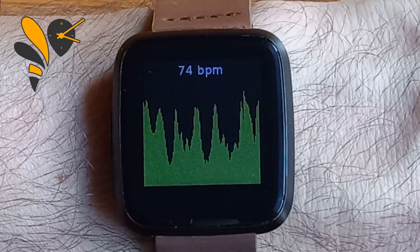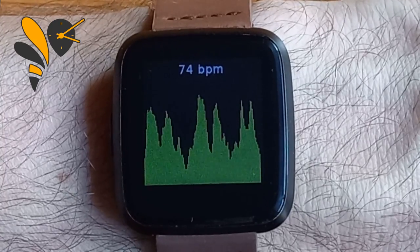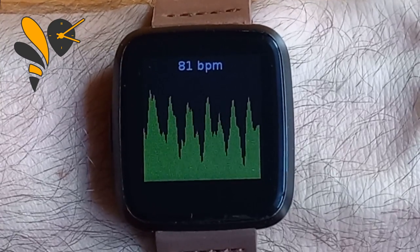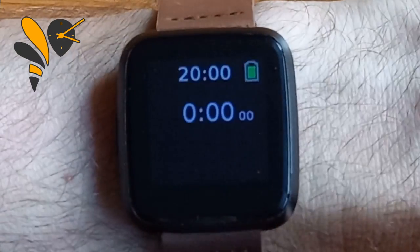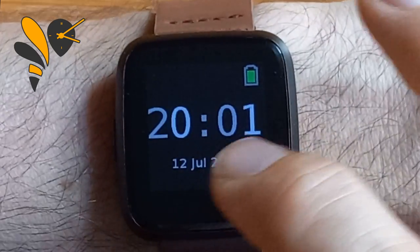This filtered shape is what we actually run the heart rate detection on. At the moment we have a very simple heart rate detector based on auto-correlation — it just checks to see when the signal essentially cancels itself out. That's the heart rate detector, which is really quite nice to see. I've been experimenting with the colors a bit and I'm still not quite happy with where we are on the colors.